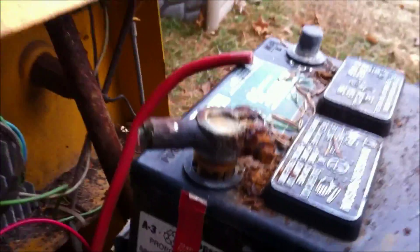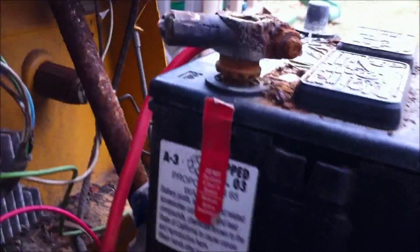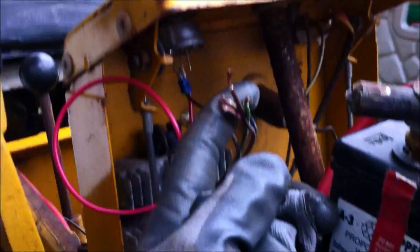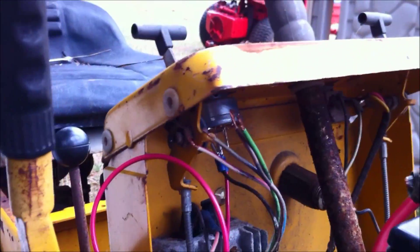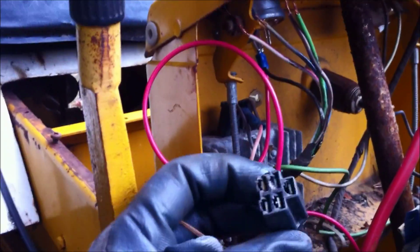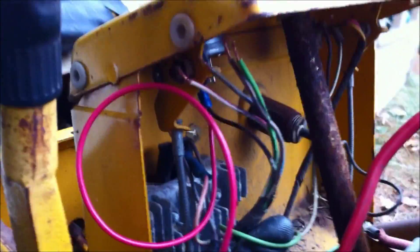The battery post has just pulled right out of the top, so I ended up cutting the wire right off — it's worthless anyway. So here's the smart thing of the day: I cut all the wires off the old key switch and tried to use a continuity tester to figure out where they go. This idiot had a green wire going into the S terminal, which should be the solenoid — but where does the other side of that green wire run? It runs right to ground.